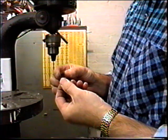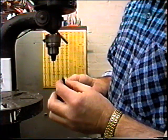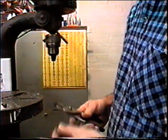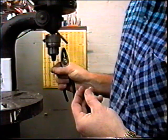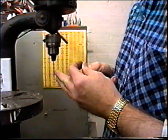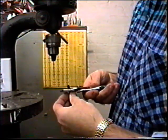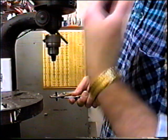These are the little arrow shaft ends that come with the Dave Brown arrow shaft kit. There's only one problem. None of them come with an 093 hole, so whether you're using the ones that are a lot smaller or a little bit smaller, you have to run an 093 drill through them. By the way, it's a good idea to invest in an accurate 093 machinist drill, because the horns should be soldered, the bushing should be soldered in place, and just run a drill through slightly so you have a nice tight fit. Again, a drill is about $2 from any machinist supply store. It's an accurate drill. It's not a hardware store drill.